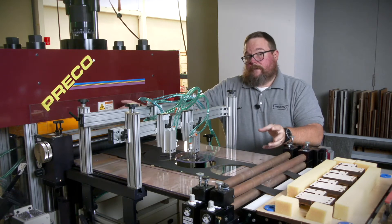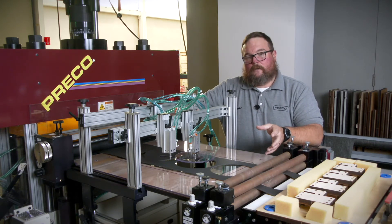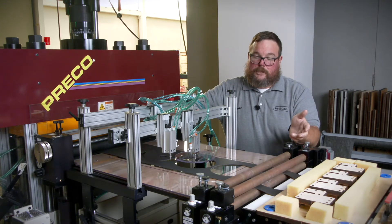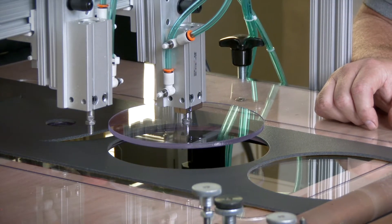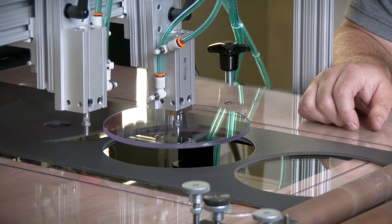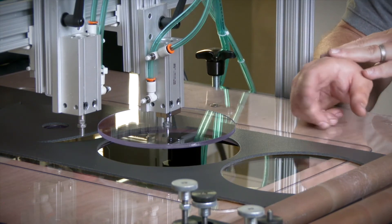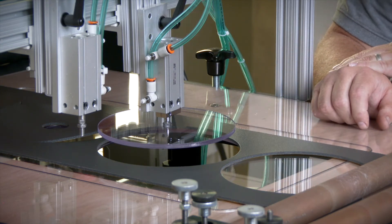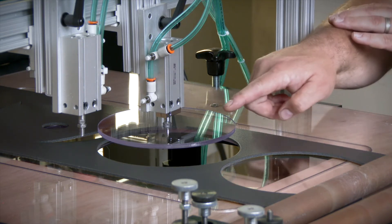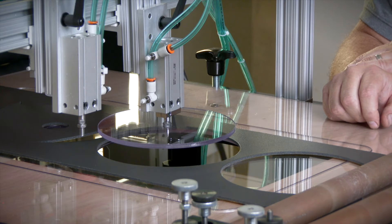Some materials and some part geometries you may have to increase that, which isn't uncommon. We just want to make sure that we've got enough support underneath the part so that the slugs don't fall out prematurely and so that it's not so small that we have a difficult time getting them pushed through. Your die maker can make them, providing both the male and female portion, but a lot of people make their own. This one I've made for this particular process — it's made out of quarter inch thick PET-G that I've cut on our laser system. You can see I've got the male portion knocking out the part, and I've got a removable insert for the female portion so that I can change out quickly and easily.